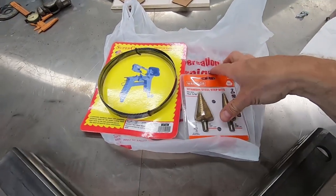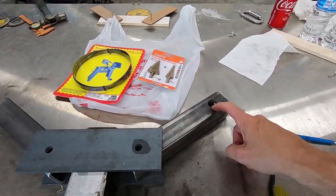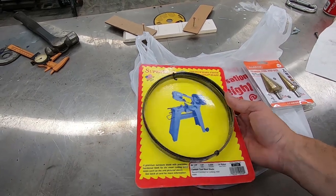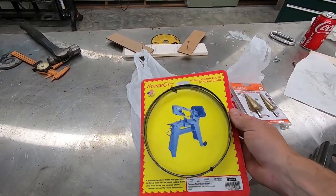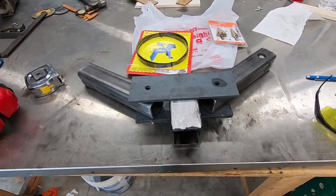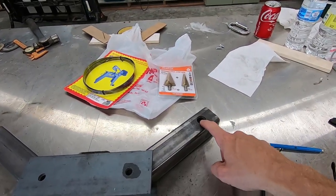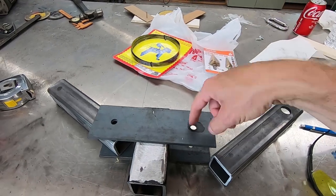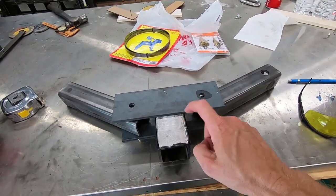I took the grocery getter and ran to Harbor Freight to pick up some cheap step drill bits. That one goes up to an inch and three-eighths, so that'll be big enough to drill the hole out for the hooks I'm going to use. While I was there I picked up a bandsaw blade — I don't have very high expectations generally, but this one says it was made in the U.S. in Rathrum, Idaho, so I think it's worth giving it a shot. The one I've got has broken teeth and is pretty dull. Now I need to drill these arm holes out, then locate and drill half-inch bolt holes on the plates — that bolt is what these arms are going to pivot on. Once that's done, it'll be time to get this receiver tube welded in.